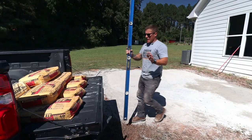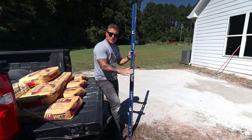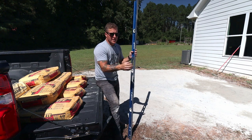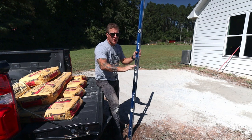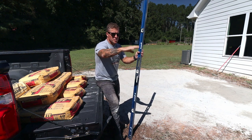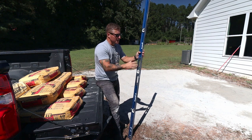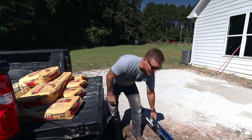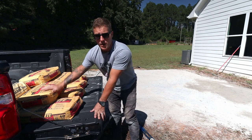So here's where we're at — we've got about four inches of M10 gravel down. I got about 80% of it down on the first layer and packed that in with a plate compactor, then went back and put about another inch on there. The PVC pipe definitely was a trick that helped out a lot. If you can get your dirt compacted down good, use the PVC pipe to help with the thickness of the rock layer, scrape it off using a skim or a level, then pack it in with a plate compactor — it worked perfectly. In four hours I was able to get the rental plate compactor back. Now we're ready to start adding our flagstone.